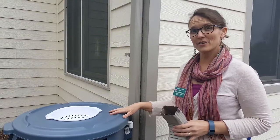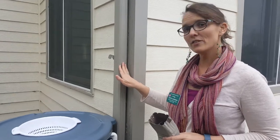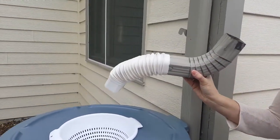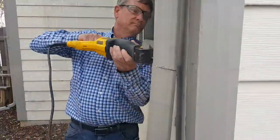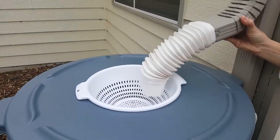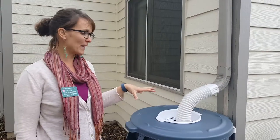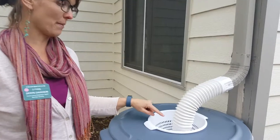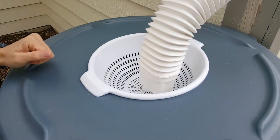Because you've elevated your rain barrel, there's a really good chance that you'll need to make some adjustments to your downspout. To do this, have your rain barrel in place, get different attachments such as these elbows, and measure so that when you attach the elbows, the bottom of the downspout is approximately one to two inches above the inlet on your rain barrel. Here we have a fully installed complete rain barrel — remember that you want the bottom of the downspout to be one to two inches above the inlet.